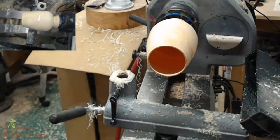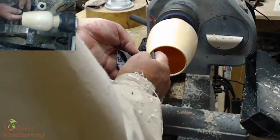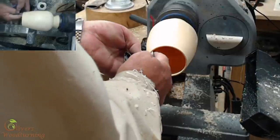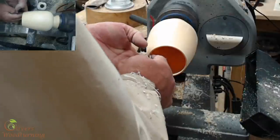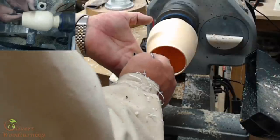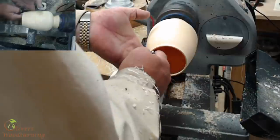just soaking that up a bit more because we're drying it out now. We're wet sanding, so I've got no extraction on. Yeah, that's what I would normally do. I get my shape, especially if I've got a fairly big entrance. I get my shape done on the outside, and then I hollow from the inside, and then I use a different light, same idea, shining on the outside, and then I look in.